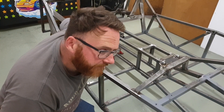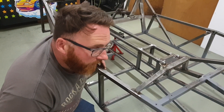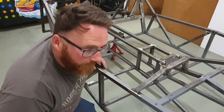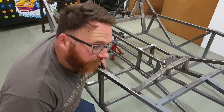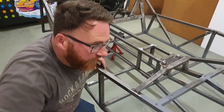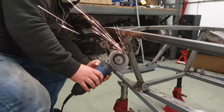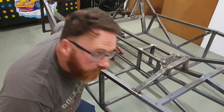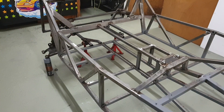And voilà — one relief. We've also radiused all the front upper arm mounts because they've still been sitting with square edges for long enough. It's literally just cutting with an angle grinder and then flattening down with a flat wheel disc — you don't really want to see that, so here's the world's quickest montage.